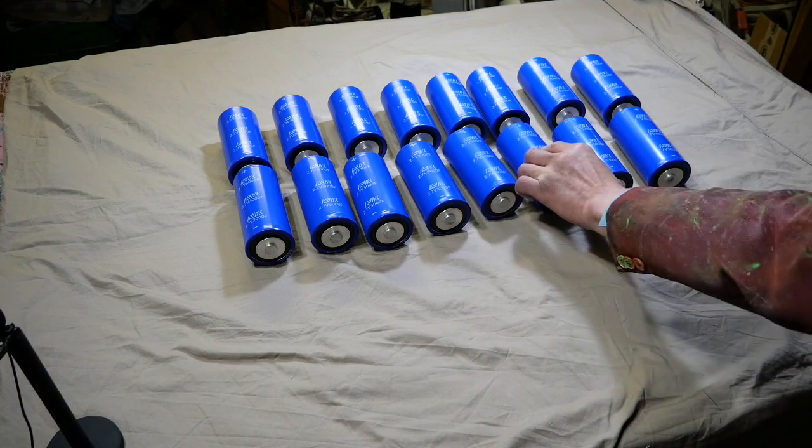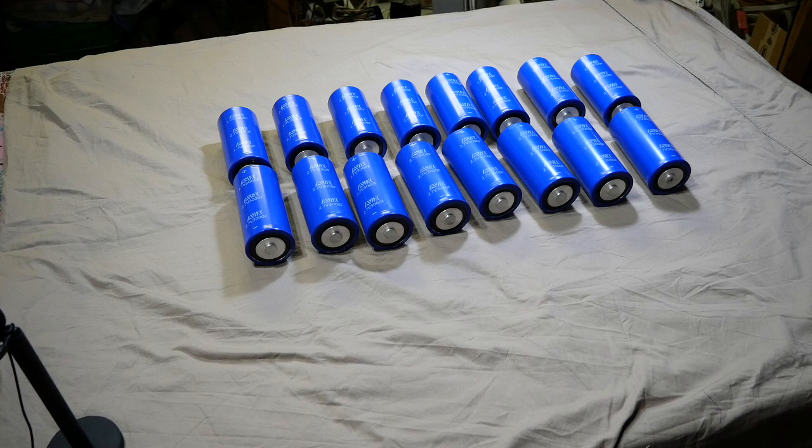I have to run that amp for at least one hour at 3 to 5 volt power without AC input — without AC power. So that's why I got these 16 pieces of 3000 farad caps to begin with, and see how far I can go with the amp. It all depends on how much current it draws.